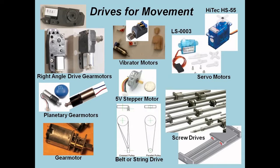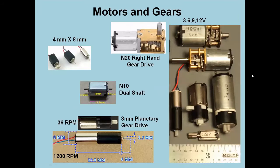And typically you're looking for very small motors. My friend says that I have the largest collection of motors, particularly small ones that he's ever seen. I've been collecting small motors that are particularly geared for over 20 years. And I typically will go and look for something that's less than $2 a throw. And a lot of the motors I'm going to talk about today, you could have obtained at one point or other for less than $2 a throw. I'm also going to wind up today by talking about servos. And a servo is a very special kind of motor that it turns out you're able to control and direct trivially with an Arduino. And that's going to become a really important thing, and we'll try and get to that.